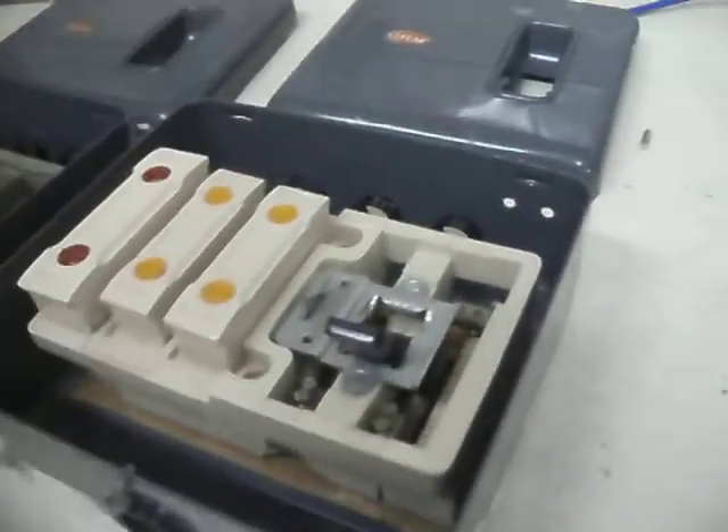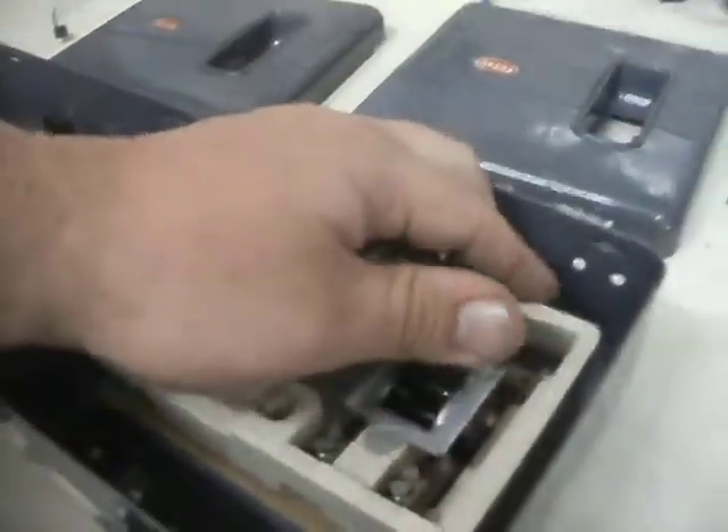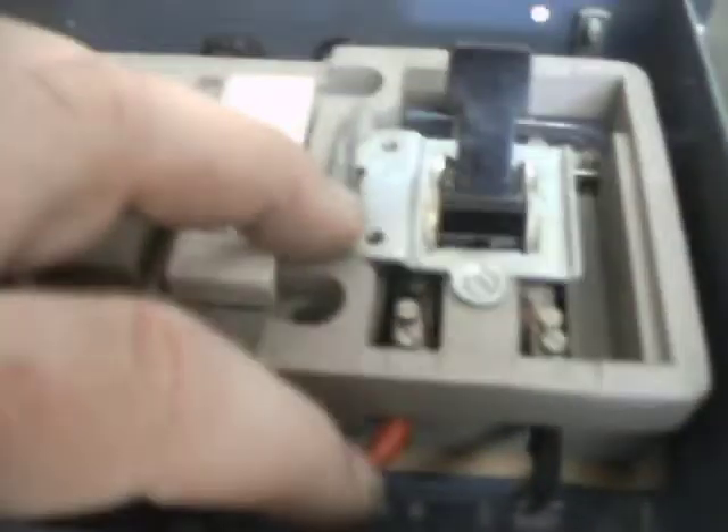And flip the power on. You don't need to push it down to turn it off though. So when you put these lids on, that depresses the catch — quite a nifty little safety device. Just like the other one, you have your live in, as indicated by the cable colours. Red is live over here in the UK, or brown in modern wiring. This is old, so years ago it would have been red, but today it's brown. Two screws to terminate the cables on both. Neutral block at the top there.